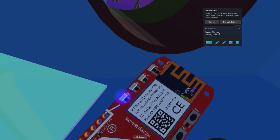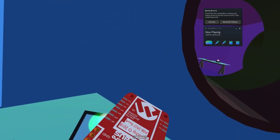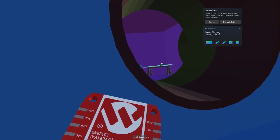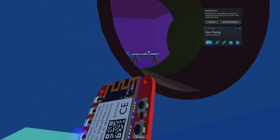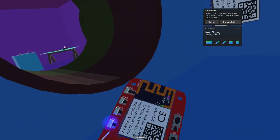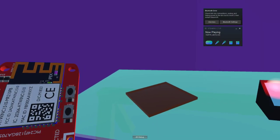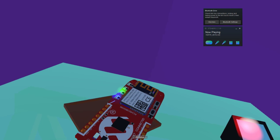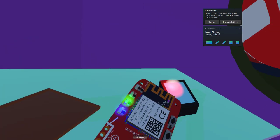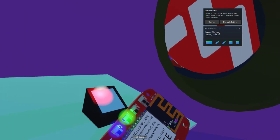That's going to be the root certificate that exists on the Wink module. It's programmed in there at the factory. Or the end user, if they want to go to a different provider, can connect pins to this RX and this TX. That's going to give them direct communication to the Wink module, or they can apply the update to it, using the existing solution out of Studio for updating the firmware and the root certificates and everything like that. So if they're in connection to their broker, then we're going to see that green LED go static.